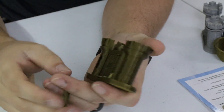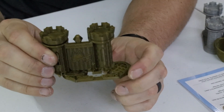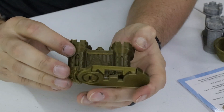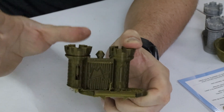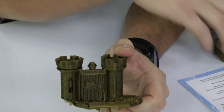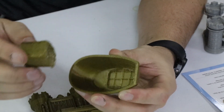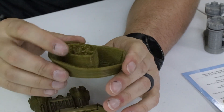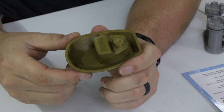Then I started slicing my own things. I did Angus's torture tower castle and had a pretty gnarly layer shift early on — that was because I tried upping the speed. Then I tried the toy boat, which super under-extruded. My temperature was too low — around 200 or 205 — it looked like it had a clog. So I put those aside and then successfully printed another boat after raising the temperature up quite a bit.